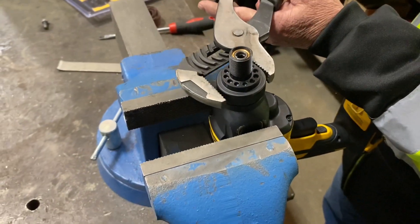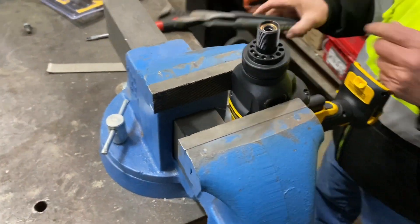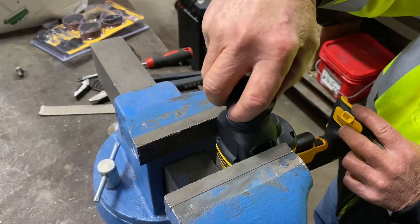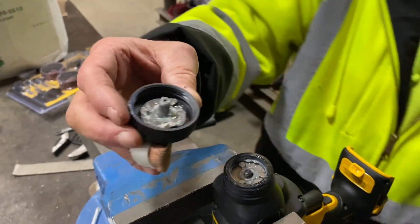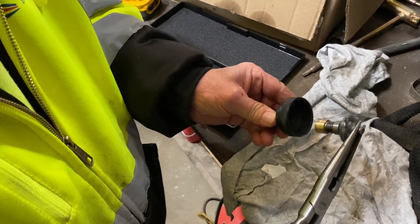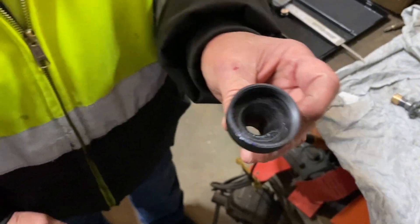To get this apart, we put it in the vise — it's a left-handed screw, so you've got to use a pair of channel locks to undo that. Then we got this little metal insert. Get a pair of needle nose pliers and it should come right out. Now you have your screw adapter piece that we need to modify to make it fit.